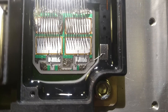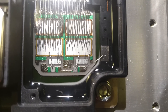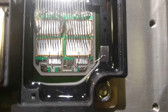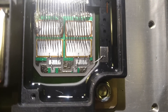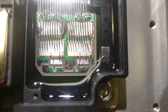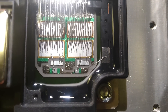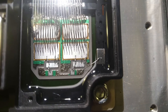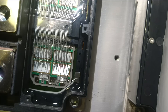So it will not automatically shut off the IGBT, but just limit the gate drive so that the current through the CE junction falls below the safe operating area — but enough to save the IGBT in case of a short circuit. This depends on the junction temperature and the rising edge on the DI/DT curve.